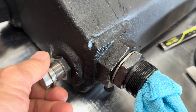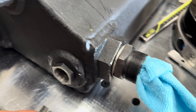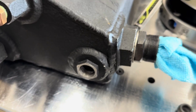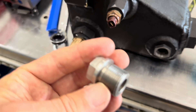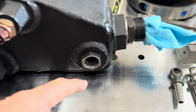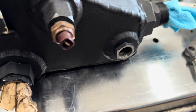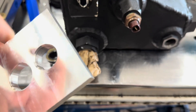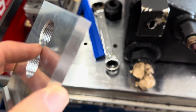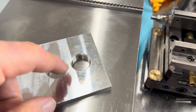The plug leaks, and in the final analysis the plug stripped out, and there's really not much you can do with it other than replace it. This is kind of a one-of-a-kind bolt. We can't put any kind of insert in there. But what we can do is take a piece of aluminum plate and use the CNC to cut a new threaded hole.